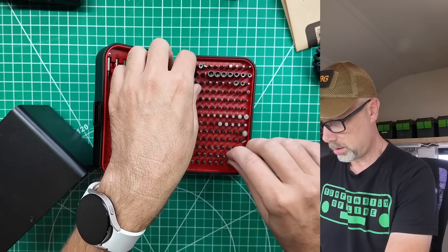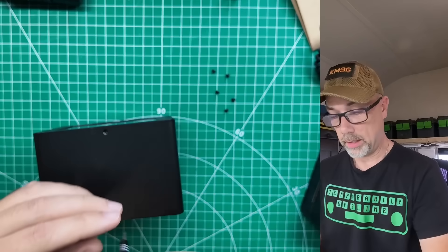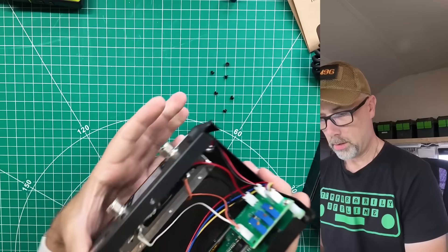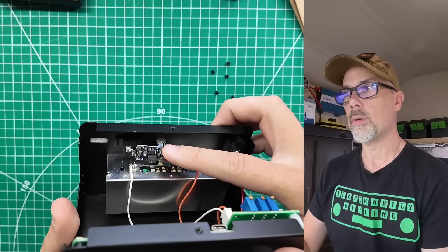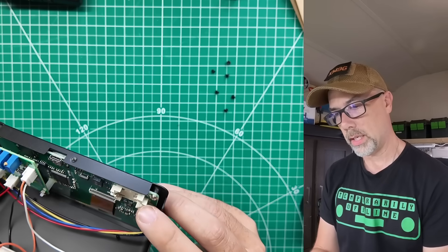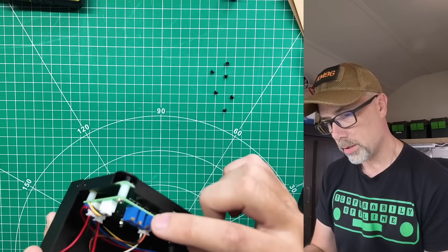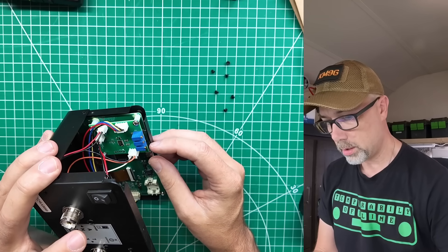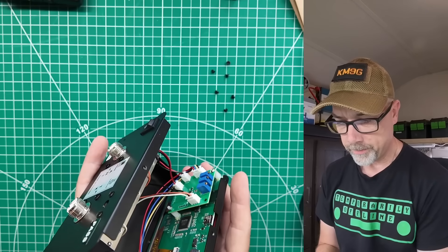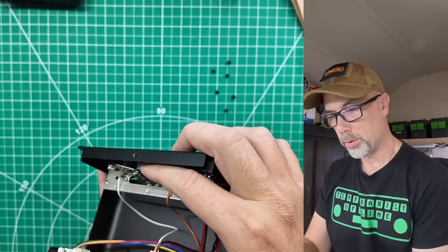Four screws of equal size, plus two screws on top — so it won't accidentally disassemble on your workbench. Inside we've got a little buck converter, the display, a Nuvoton display. This is probably a common off-the-shelf display. There's an SD card, some tweaking for reverse, forward one, and forward two — probably auto-detection for HF versus VHF.